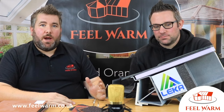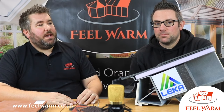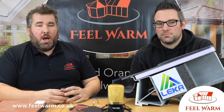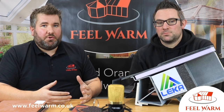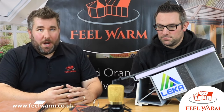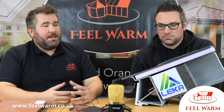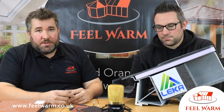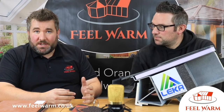The amount of customers that we've had to go out to correct work that's been done from overclad and underclad. Basically what they do is they take the polycarbonate or glass panels out. Sometimes they leave them in, which is doubly bad. But regardless, all they're doing is putting structure above and below the existing conservatory frame. The conservatory frame was never designed to hold that kind of weight. You're going to be putting timber, insulated plasterboards, additional insulation above the plasterboards potentially. You're going to be putting timber on the top, tiles. They should at the very least be trying to reinforce it.